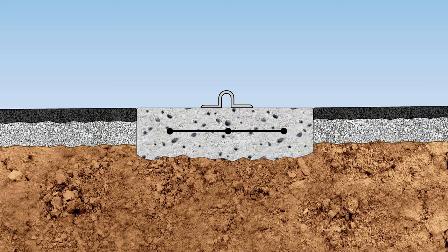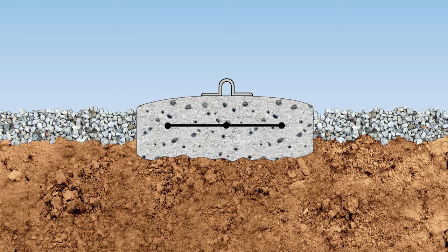If the driveway is bitumen, a strip will need to be cut out and replaced with concrete — once again the concrete can be colored to match the bitumen. If the driveway is gravel, a concrete strip will need to be installed that is raised up in the middle to keep the gravel off the track. All concrete strips should be at least 300 millimeters wide and 150 millimeters deep and reinforced with trench mesh, as there will be vehicles driving over them so they need to be strong.